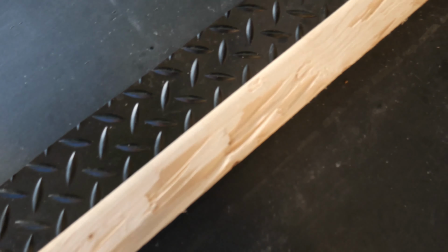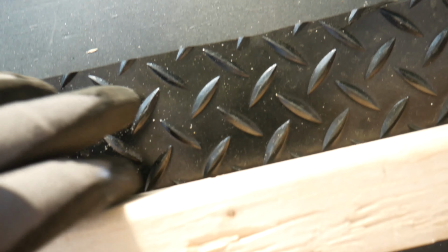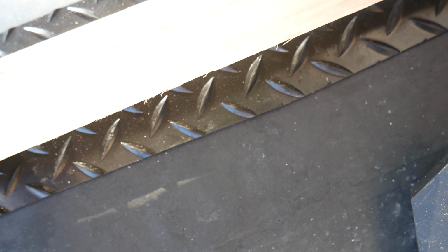and this stuff will go underneath each of these floating joists, both to protect the underlying EPDM membrane, because these things will sort of wiggle around and move as people walk, and they could wear weaknesses in it over time. And also this little diamond pattern here should help keep water from sitting under these joists and drain off a bit easier. So these float not only on the deck, but on each of these little bumps.